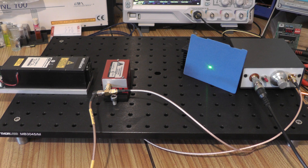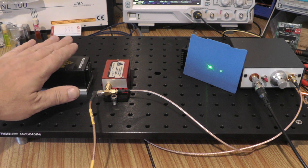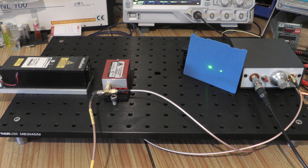Going back into the frequency setting, I can easily modulate at 10 hertz, 20 hertz - probably not visible to camera but there might be a little flicker. The beauty of this is we can take a laser that we ordinarily couldn't modulate - like this DPSS laser - and modulate it no problem. This works equally well for argon-ion lasers and helium-neon lasers, which are other classes of lasers that aren't particularly easy to modulate. We could even transmit serial data over an optical link if we wanted to.